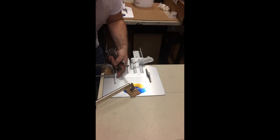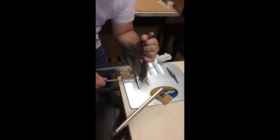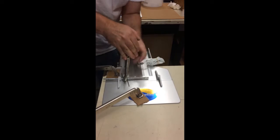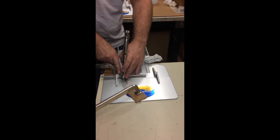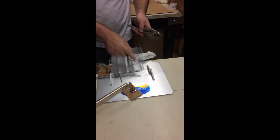So we'll start the rod into this assembly, and we'll keep it flush so that we can put our spring with its little tab side up. That way we could feed our rod through. And I'm going to feed it most of the way through, maybe 2 inches from getting to the other side, and I'm going to release it in place so that there's a little bit of a gap in between the spring and these ears here. Alright, so it's released and up.